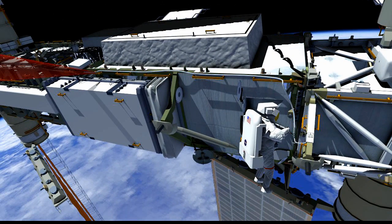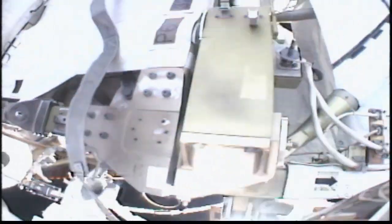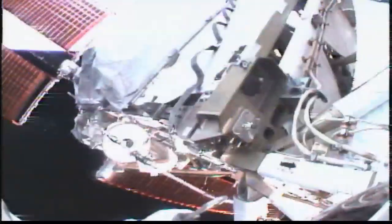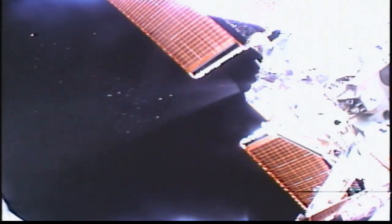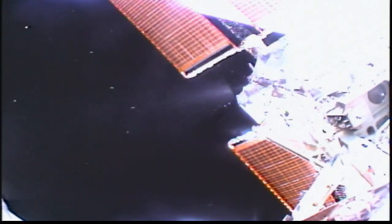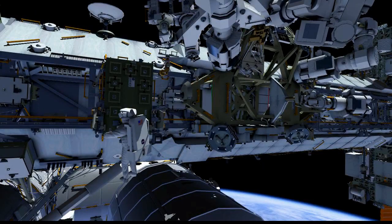Here you can see the vent tool and vent tool extender, with a cone showing where we expect to vent the ammonia out of the system. Here you can see footage from STS-134 where Drew Feustel did the exact same task — they did a fill of this system as well. You can see him open the valve to the vent tool and then look back over his shoulder as the ammonia vents out of the system. We expect a very similar view on US EVA 33. Expect that vent to take about 17 minutes to fully get all the ammonia out of the line.